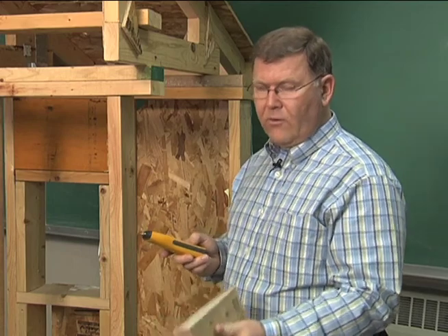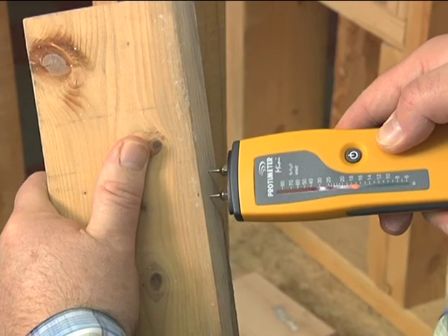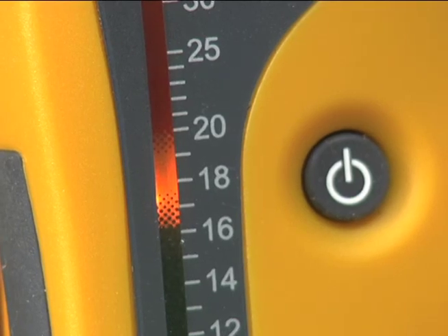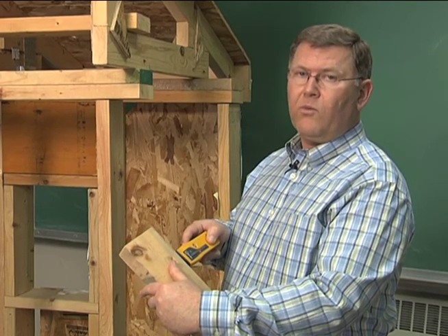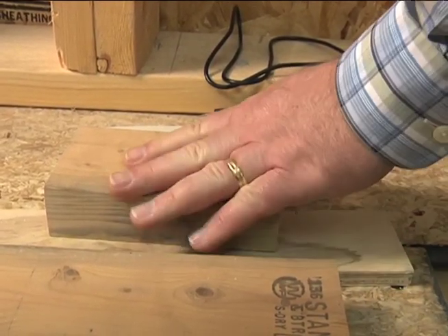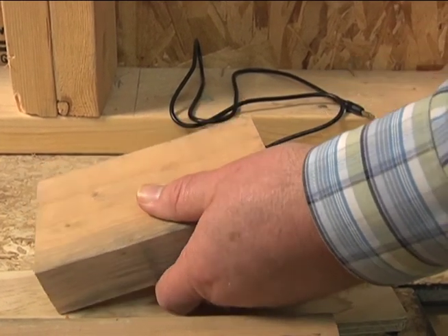In this sample of wood, it's not a uniform moisture content. Going to another location, it reads between 16% and about 19% moisture. That falls within the yellow band on this meter, indicating it is in the warning zone or danger zone — not wet enough for decay, but enough moisture that if we were to enclose the wall cavity, we would likely end up with mold growth on materials inside. It's important that we don't just go by looks or feel, because wood may look and feel dry but actually contain significant moisture.